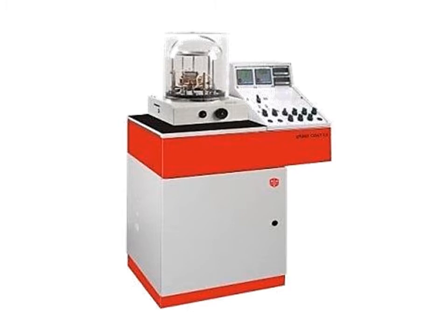Apart from this, just below the bell jar there are two handles. One is bigger and one is smaller. The smaller one is the needle valve to control the flow of gases for plasma generation or plasma cleaning, and the bigger handle is to rotate the turret, or the target, under vacuum from outside. So without breaking the vacuum, we can change the target inside.